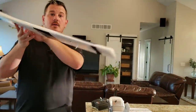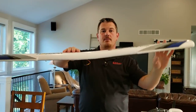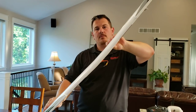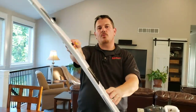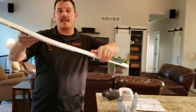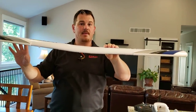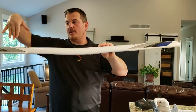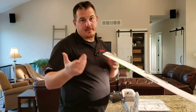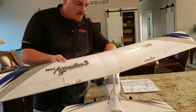Because when you run ailerons, one goes down and one goes up. So if this was down, that would lift the wing here. And this, if this was up, then it would push it down. So they work together to roll the plane. When they work at the same time, both down, that's called flaperons because the ailerons are acting as flaps. And spoilerons would go up. Spoilers go up and they spoil lift. Ailerons also do the same thing, but they do them opposite on one side from the other. All right.